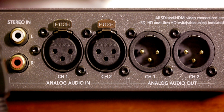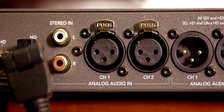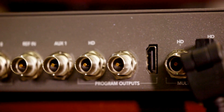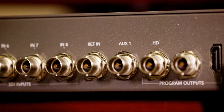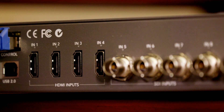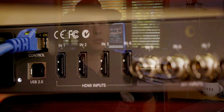The ATEM has a bunch of separate audio inputs, which are pretty handy. If you feed audio in from a mixer, and you're using SDI out of the cameras, your processing delays are going to be about one line, so you'll never see any sync errors. However, if you're using HDMI out of a camera, you could have up to an entire frame of delay — and that's caused by the camera and the nature of HDMI, not a fault of the switcher. So if you're using all HDMI cameras, you might need to purchase an audio delay unit and delay the audio a half to one full frame to bring everything back into sync.